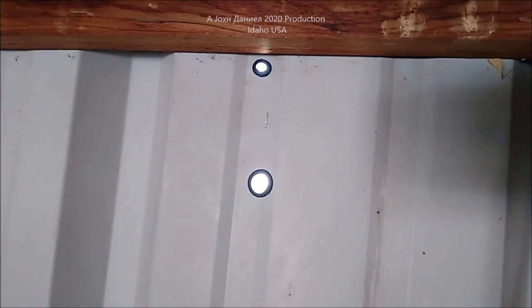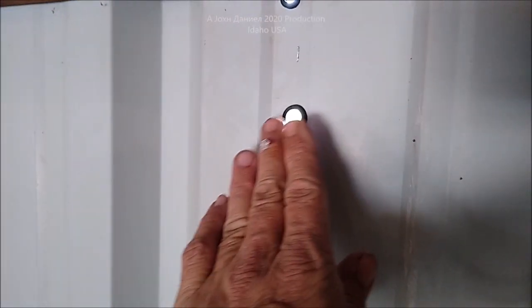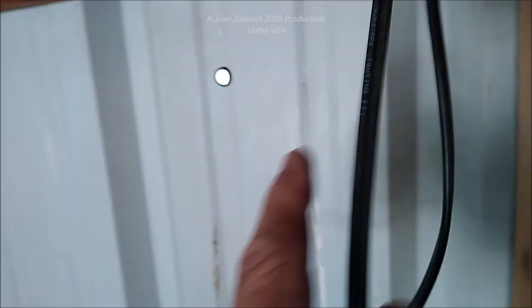Going up here again where I have tons of supplies and still finishing some walls. I have another one on the back of the shop — you can see a cleaner view of the grommets here. I use three-eighths and half-inch grommets through the metal, mounted in the little ridge that goes outward on my metal building. If you use this on a wood surface, you can use a metal body — just don't ground it. I've got 12-gauge wire and a 14-gauge runner going further down for the same thing.